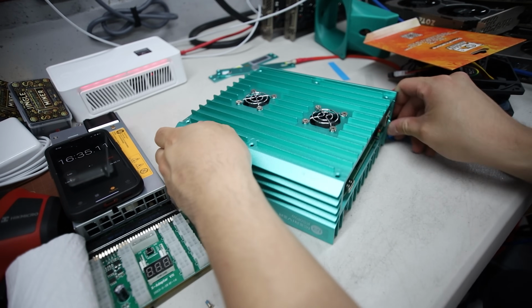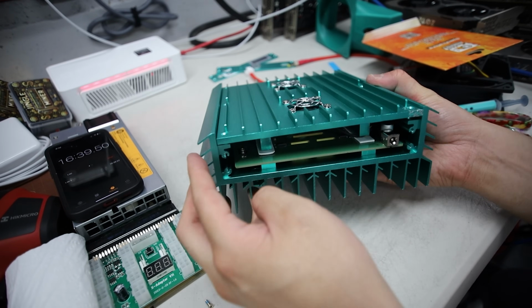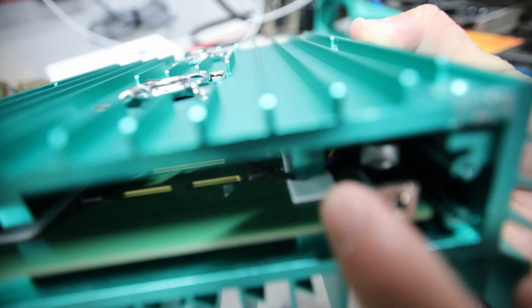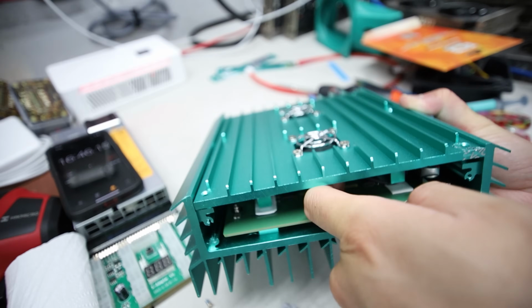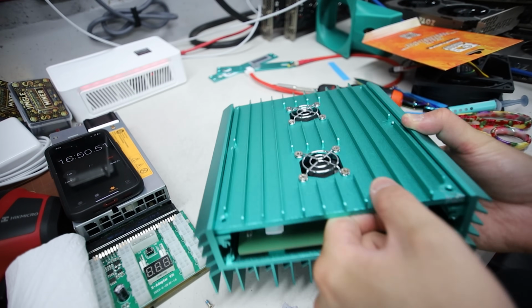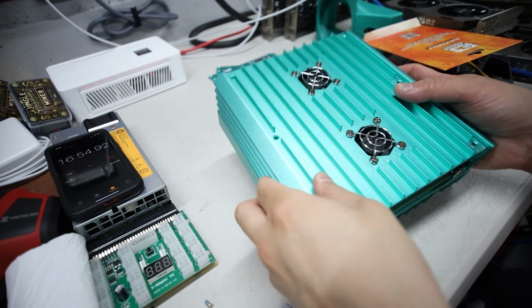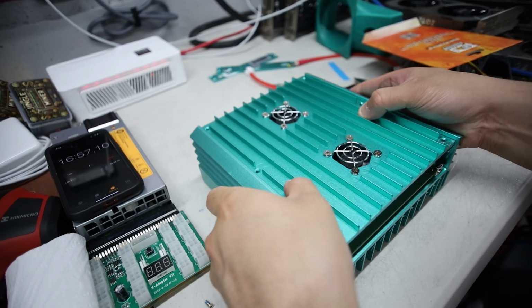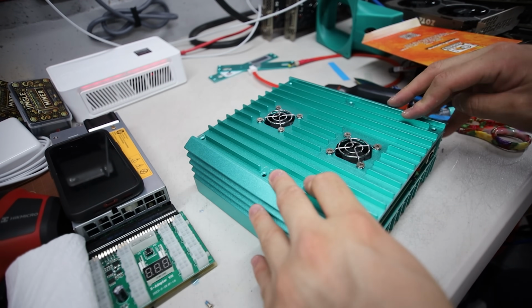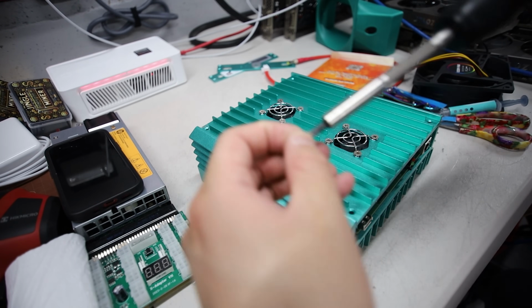Oh, I think it's caught on the other side. Yeah, look at that. You gotta make sure the cable doesn't get underneath there onto the thermal pad. That's bad. Like so. Okay, so make sure. Gotta make sure I eye it. Okay, I have to lift it up a little bit. Okay, just making sure it's all in. Okay, let's screw it in. So 6 of these long pieces.